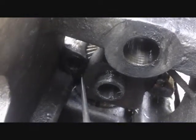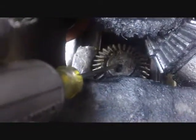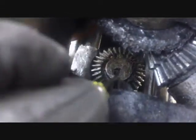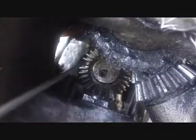I can't remove the saddle until I get that gear out on the other side, which is on the other end of this shaft right here. My understanding was that once I removed this shaft, that would give me access to the screw to remove this gear. But what's weird is there's a hole right here - it's kind of chewed out, it's a threaded hole. So I don't know if there's a set screw down inside there that I can't quite see.